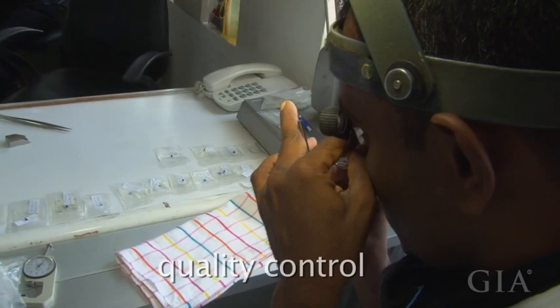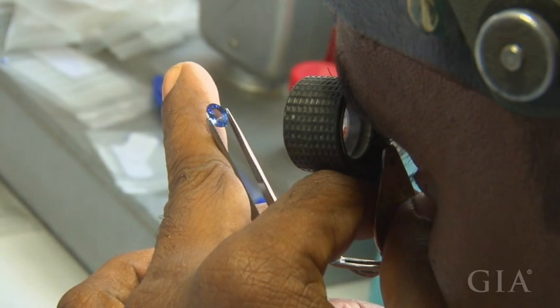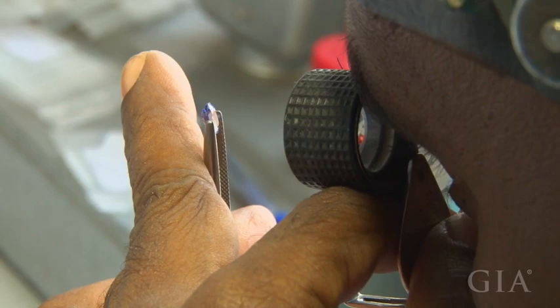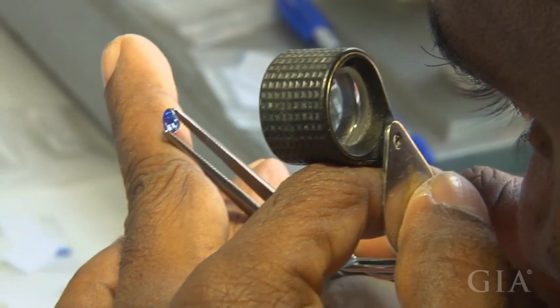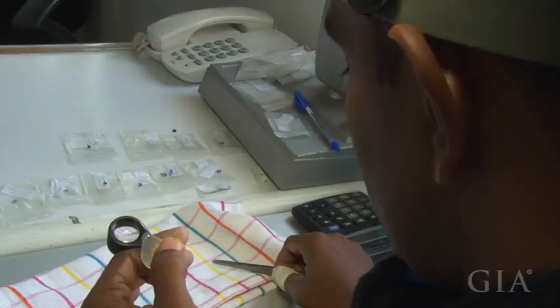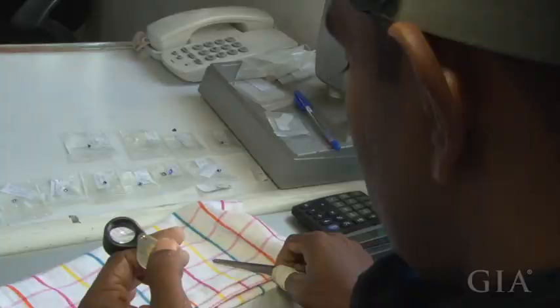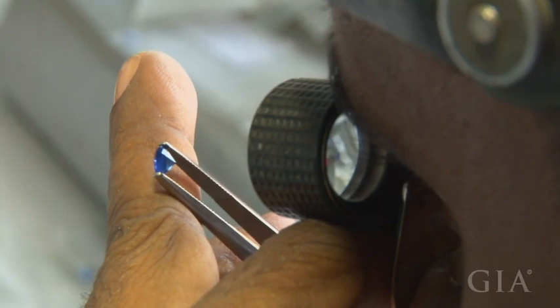Once the cutters are returning the pieces to the production supervisor, she will hand it over to the quality department, and the quality supervisors are checking quality, and if there are any repairs, they will issue the repairs, through the form I showed you, the repairs issuing details form. And after getting repairs, he's checking final quality. If there are any repairs, we are marking the type of the repairs on the piece of paper, and we are again issuing the piece to the relevant cutter to complete the repair. And we are giving an exact time to complete the repair.